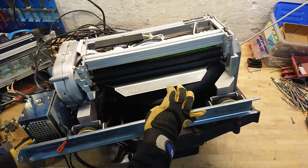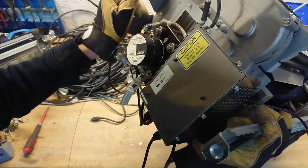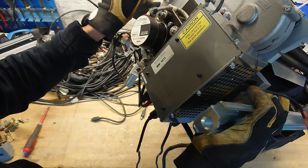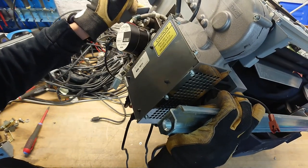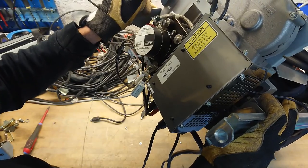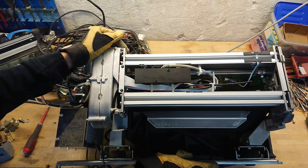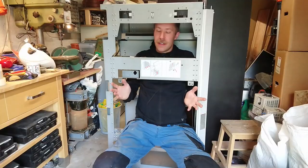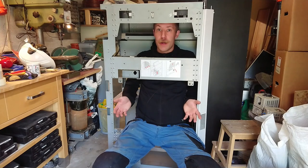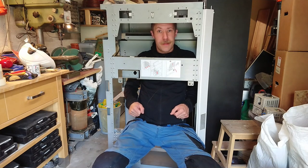At the side here there is a shielded box which I can only assume is the power supply for the PMT, as it needs a few kilovolts on the plates inside to accelerate the electrons — so one photon can start a cascade of electrons up to a signal we can read out. This will get its very own teardown video, so look forward to that. That was some really nice parts. This was just part one, so I hope you'll follow me for part two and part three, where we look at the scanning component and also the computer. Until next time!